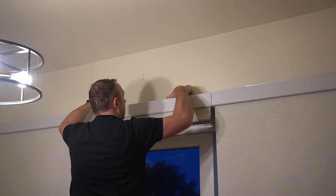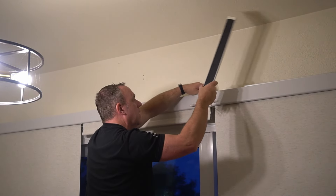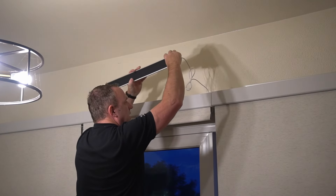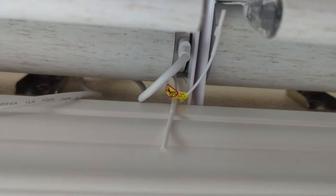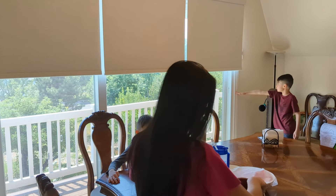The first option I went with is solar panels. These blinds are rechargeable so you can plug in a USB-C charging cable to charge them up and they last for several months. But if you never want to deal with that, you can get solar panels. Now these are glass doors so I can't put the solar panels on the glass itself. I thought I'd put them on top and maybe the reflecting light from the ceiling would be enough to power them — that is not the case. It provided enough power that the battery drains really slowly but it doesn't charge the battery. So I got some nanotape, put it on the back of the solar panels, placed them just above the windows, and found that if I close the blinds just a little bit, the light reflecting off the blinds is enough to charge them. That's definitely an option if you don't have the ability to put the panels on the window itself.